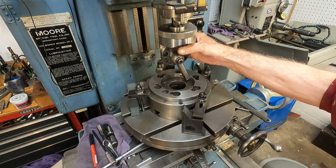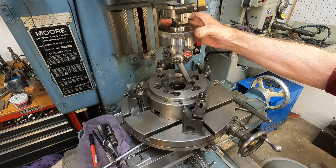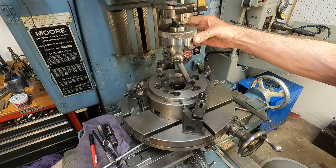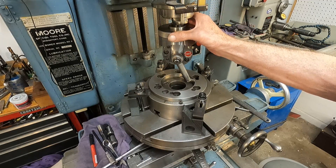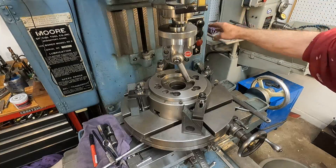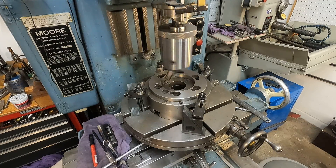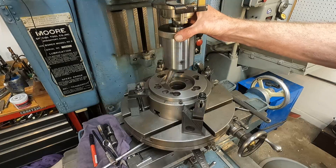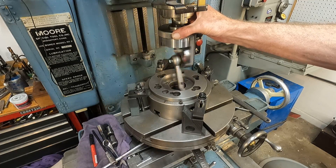Okay, I like that right there. I'm going to start it up and get it in gear. When it feeds, I'm going to have my hand on this collar and hold it. With the standard head, each revolution the slide will travel five thousandths of an inch. If it's going too fast it'll chatter, so I'll just let this slip a little. We're at about 286 RPM - let's start feeding it. It's cutting.